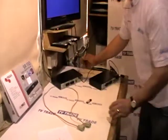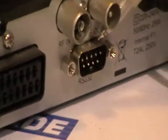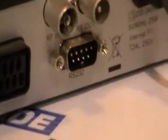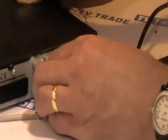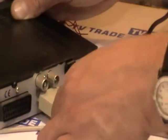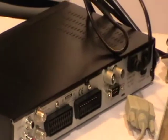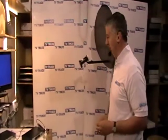If we look on the back of traditional satellite boxes such as this, there is an RS-232 port here and there's another one on the next box. We grab this cable here, slot it in, and lock it into position with these locking arms. We get the next lead and simply connect it in here. There's actually a video that does this in detail on a Tri-X box in the SR-110 user manual on our website, just to give you an idea of what it's for exactly.